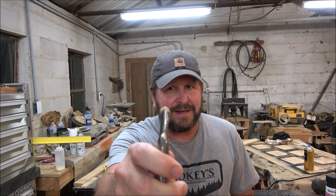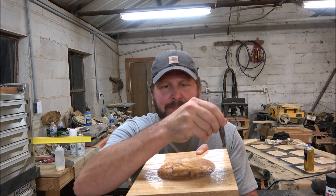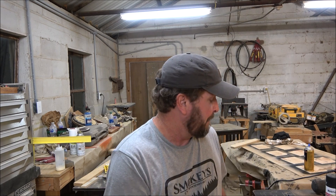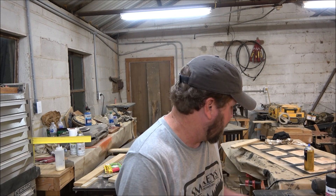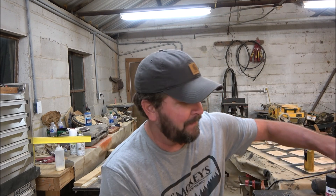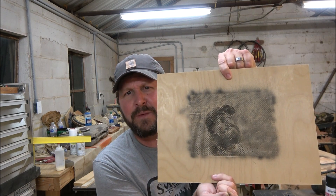I don't use a half inch one for 3D — I use either an eighth or a quarter, usually a quarter inch bit. It's the rounded tip and it'll just pass back and forth over it. So that's the ball nose. The other bits I commonly use are a 90 degree V-bit, 60 degree V-bit, and the newly acquired 30 degree V-bit. The 30 degree V-bit is what I did the halftone in — you remember it from a couple of weeks ago.